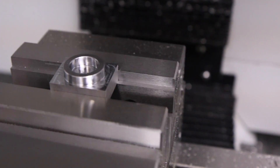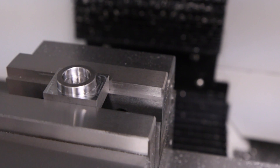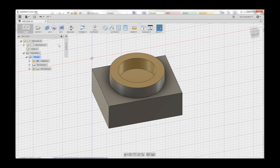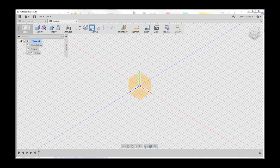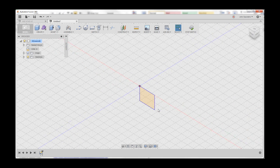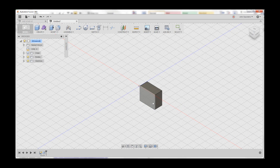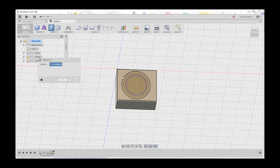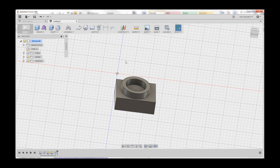I actually have a little surprise, but before we tackle that surprise, let's take a quick look at CAD, CAM, and the feeds and speeds we used here. We used Fusion 360. We made this part really quickly. Just to show — we'll do a new design, sketch this face, hit R for rectangle, dimensioned at 1.25, tab 1 — actually it was 1.25 by 1 there. Q to press pull, negative 0.625, and then a circle on this face of 0.9, and one inside of it that was 0.65.